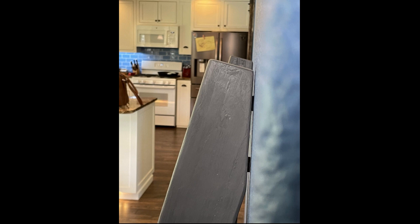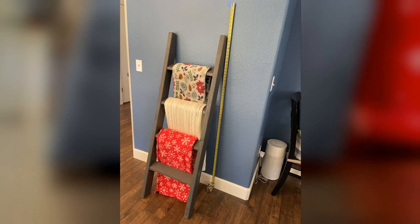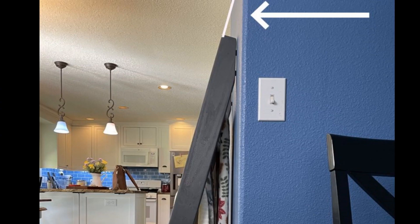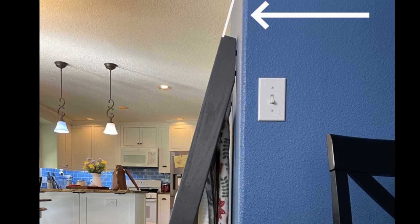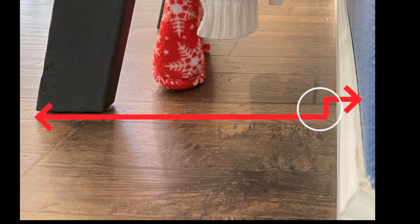Let's get going. Part of the process of building wall ladders is figuring out what angle to cut the top of the side rails so the ladder leans flush against the wall, and doing the same with the bottom rails so they fit flush with the floor. If you can use a tape measure, it takes just one thumb to figure the angles. Here are the measurements you need to gather: the height up the wall the ladder will reach — if you're going to cut off the points at the top, you need to account for that. Next is how far from the wall the bottom of the ladder will sit; don't forget to account for the thickness of any baseboard. And finally, the width of the side rails used. I used 2x4, so the thickness of mine is 3.5 inches. Now let me demonstrate with my thumb and my measurements how I figured out the exact angles for my ladder.